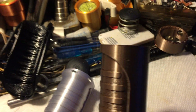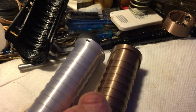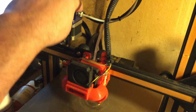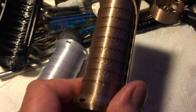So I just wanted to follow up that, when you start getting nasty prints and under extrusion and things like this, it is almost always the hot end, because nothing else changed, right? I didn't change my E-steps. My extruder's still the same. Nothing failed up here. Nothing changed. And then all of a sudden I get this, right? And by the way, it was all of a sudden. It wasn't a gradual thing. And so the hot end failed.